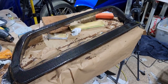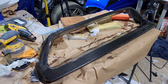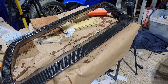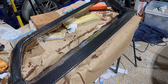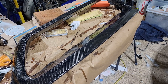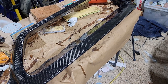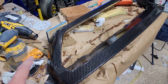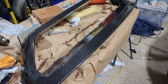One other thing I noticed on a previous project: you do not want to use a mechanical sander when sanding the epoxy. The epoxy, if you get it too hot — I think it says on the data sheet above 180 degrees — it will actually start to deteriorate. It actually turns a little whitish, kind of almost a milky color. So if you sand this with a mechanical sander it can get pretty hot and you'll ruin your whole project. Stick to hand sanding.